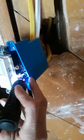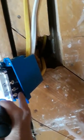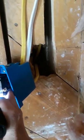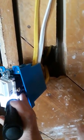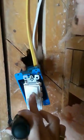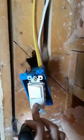So we have a white wire here, black wire, and our red wire. The red wire and the white wire are our travelers. This black wire is going to run our fan. And then the white we have marked with black for our traveler. So this one runs our fan and this one runs our light.